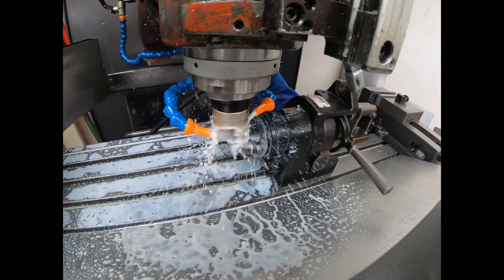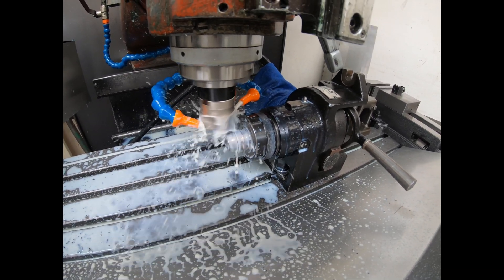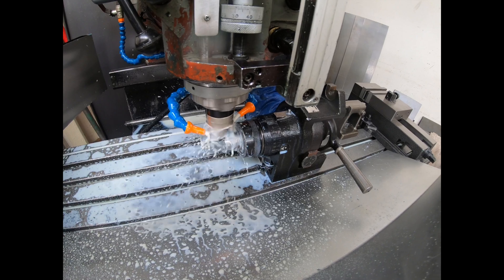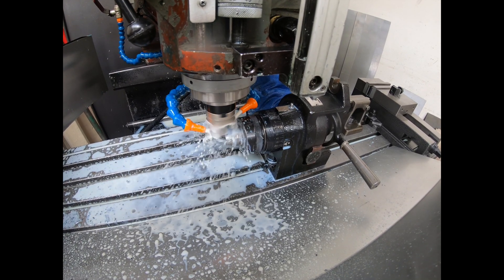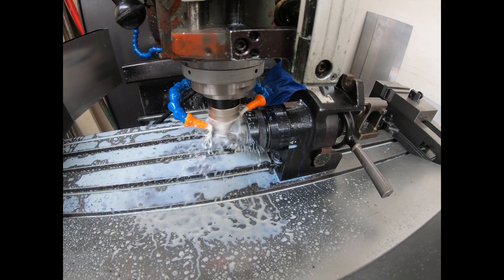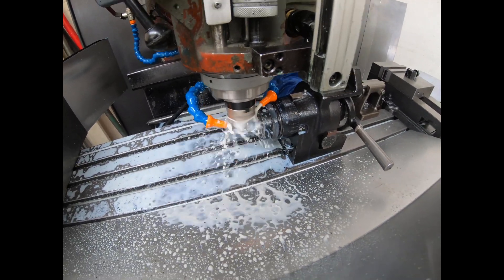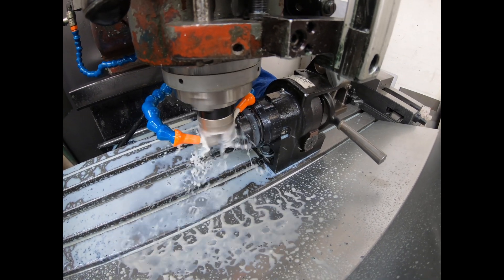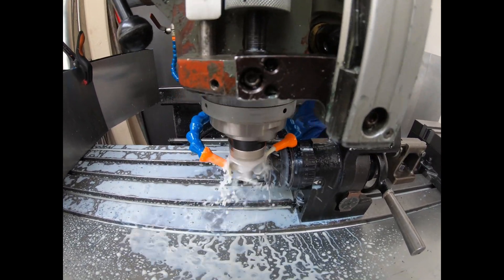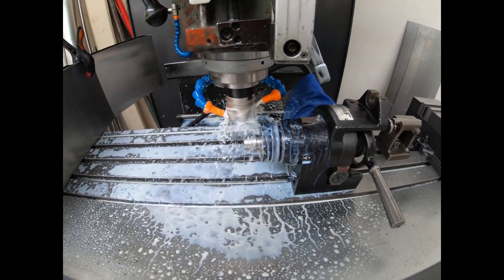So that's taken the first flat position, then the indexer turns back down for the second cut. I did try doing this with a normal end mill but I've got a better surface finish with this face mill, although you can hear the tips running on the back edge once it's passed — so it's cutting on the back side as well, meaning the head or the table is not perfectly true. But it's irrelevant to me. I'll show you when all six sides are done.